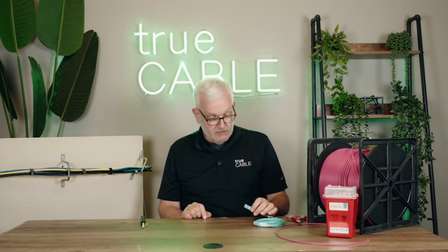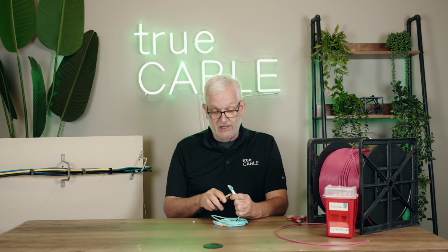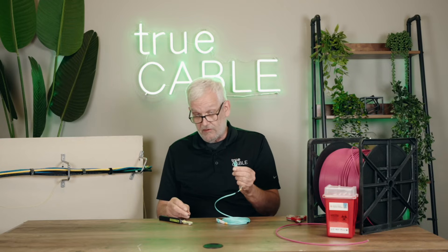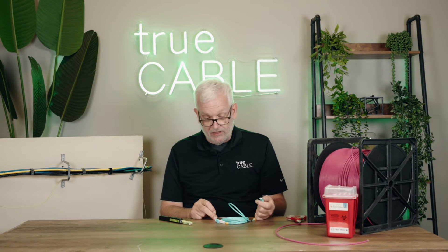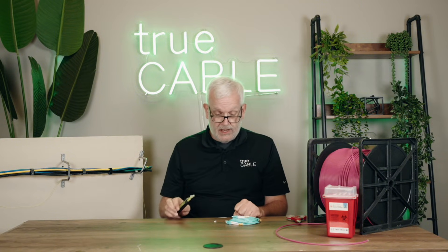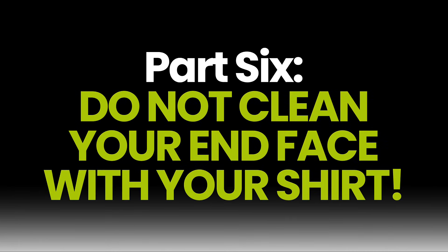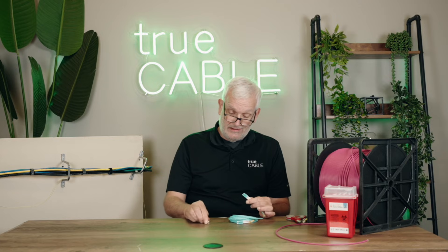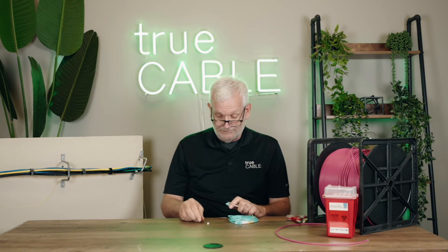Here's one for new fiber optic installers. Your fiber optic patch cord — don't ever uncover the end face without cleaning it. Every single time you uncover one of these faces, whether it's a brand new patch cord or not, you clean it. Every time you pull it out of a jack or an SFP, you clean it. This needs to be something you practice so often that it's habit — you do it without thinking. Carry a cleaner with you all the time and clean every single one, even the new ones right out of the bag. I've seen people in the field take the caps off their end face and wipe it on their shirt, thinking that's cleaning it. That's not cleaning it — that's putting dirt on it. You need a proper cleaner.